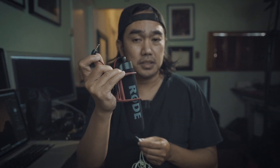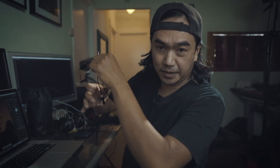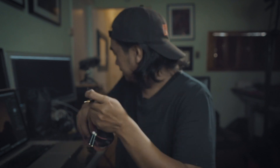So this will definitely not work with a MacBook. The solution is an adapter from TRS to TRRS jack. By the way, this regular mic jack is called TRS, and the one for MacBook is TRRS — tip, ring, ring, sleeve.